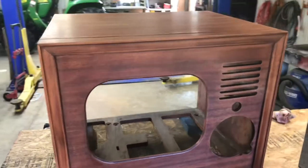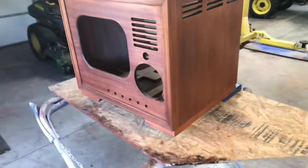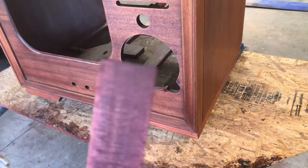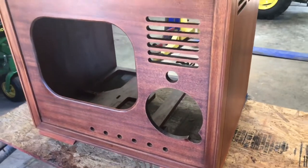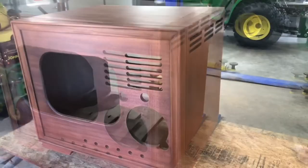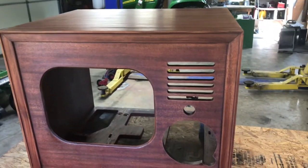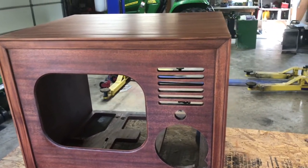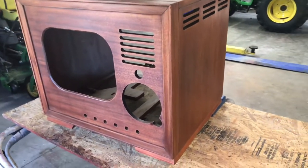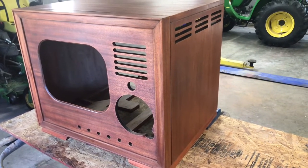The stain I have has kind of a red cast to it. Let me grab a paint stick to show you — this is the stain I'm going to put on. I think along with the stain that's already in the wood, it'll give a good deep red cast. Before we do that, we'll look it over one more time to see if there are any bad places to address, then we'll use a tack rag — kind of like when you paint a car — to tack it off and get rid of all the dust particles.